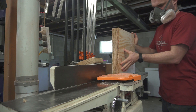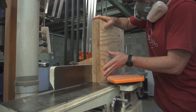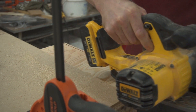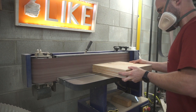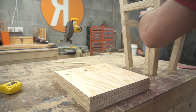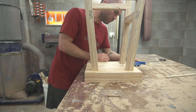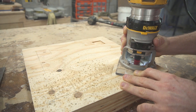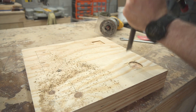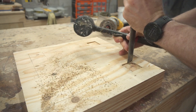This second piece of leftover LVL is going to make up the seat. I cleaned it up into a square, and in terms of rounding and shaping, this was function over form — I just wanted this to be the most comfortable seat you could sit on. I also created pockets for the legs to sit into, to give a bit of mechanical advantage to stop the tops of the legs from moving outwards or inwards, and to help with the glue up process later on.